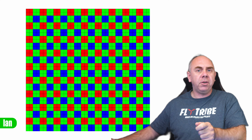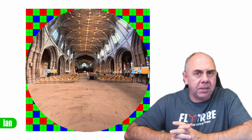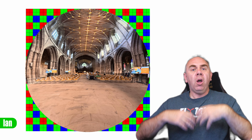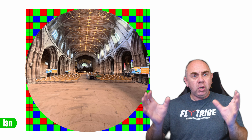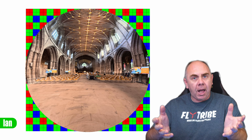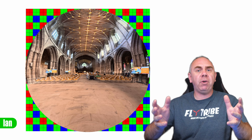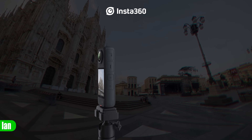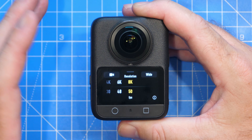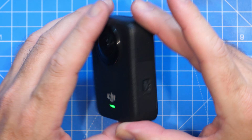However on a 360 camera it is different. First of all the image is projected onto the sensor as a circle, and whilst it does take up a very large area of the sensor, there are parts of the sensor that are not used around the sides. Further to this, because you're projecting a lot more image detail, you are not taking that full sensor sample and downscaling to your chosen resolution, because all of that extra sensor area is taken up by the additional image detail as a result of that big fisheye lens. Furthermore, the actual image output you're getting is half the resolution of the total camera specification, because they're taking the image from two sensors and combining them together to make up that 360 degree image.